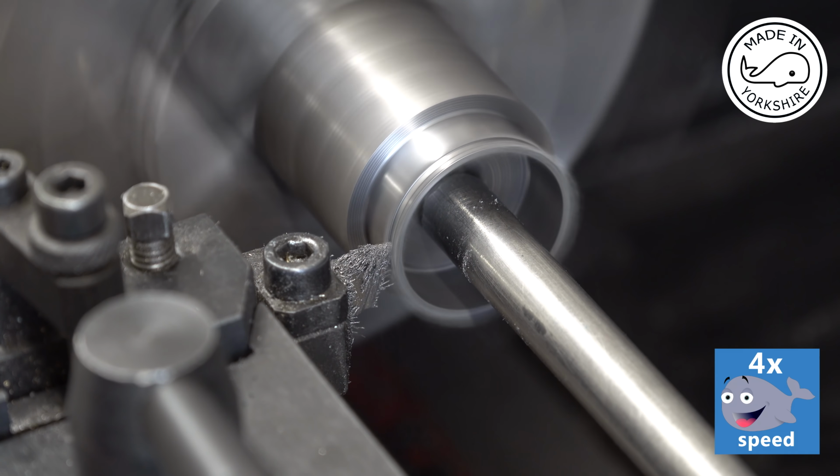Well, I just can't believe how well that has turned out. It's just unbelievable. Never made a piston ring before in my life, and Earl's method worked an absolute treat. I never thought when I started model engineering a couple of years ago I'd be working to tenths of a thou. But that method of using a flat file with emery on top, just to get that outside diameter of the piston ring spot on to within a tenth of a thou, worked an absolute treat. So I'm really happy with the result.